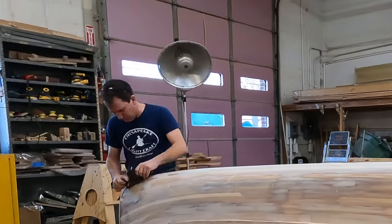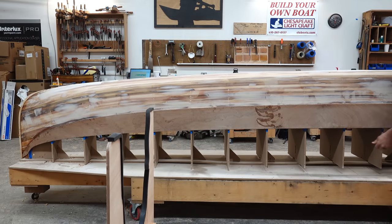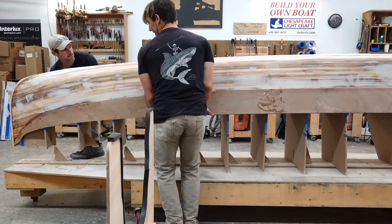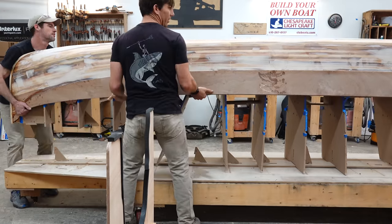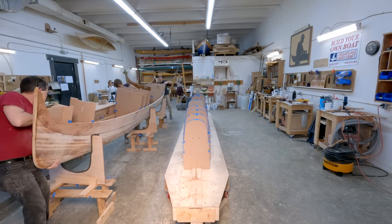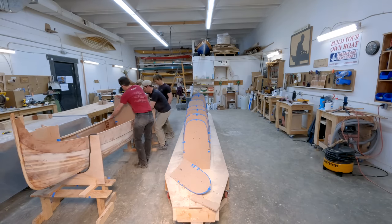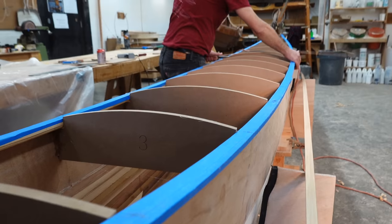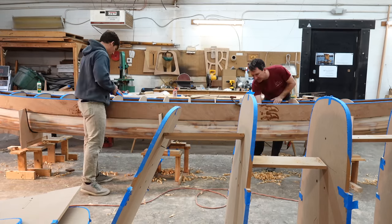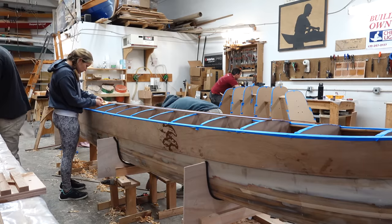Once the outer stems were cured, they got roughly shaped and then we did one last quick longboard sanding. Once we removed the canoe from the mold it was time to start making the deck. First we temporarily mounted the frames for the deck mold and taped off all the surfaces that the deck would be built on so it wouldn't permanently stick to them. Then we started strip planking the deck the same way that we did the hull of the boat.